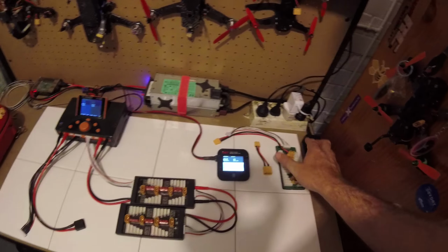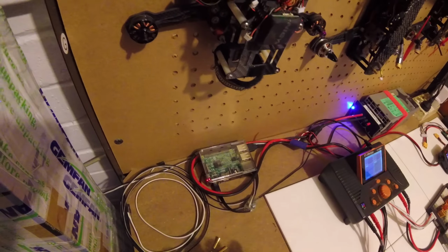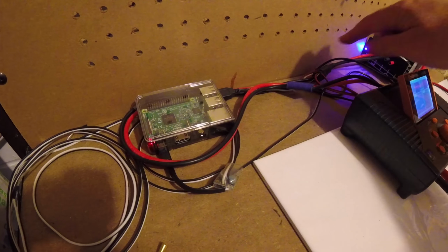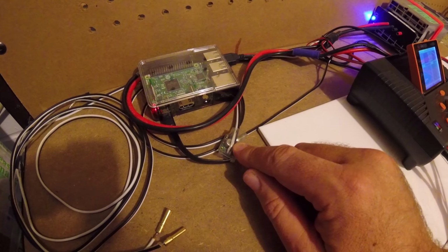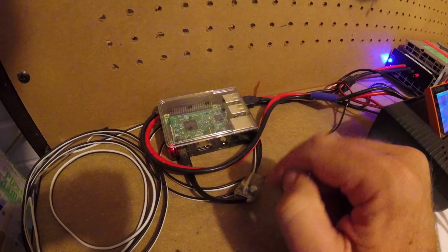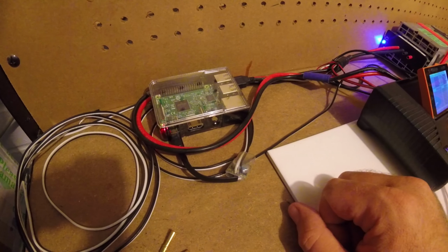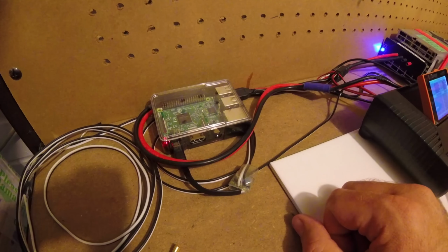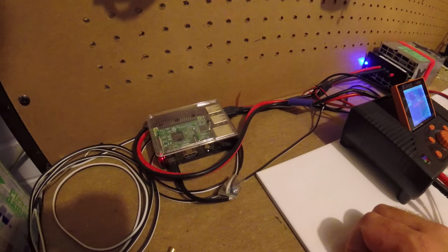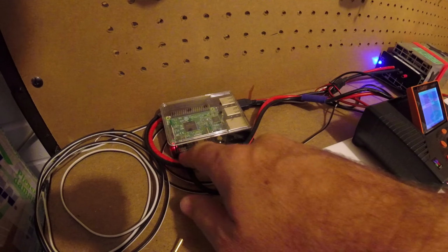So the really intriguing thing now is what's going on here. This is the Raspberry Pi, and I've hooked it up to the 24 volts via a regulator to get down to 5 volts. These things need about 2-2.5 amps, so you need a decent power supply on those. I wanted to run through this because I wanted it to have a common ground and have everything sharing ground there. There is an issue you can get with these chargers with ground loop voltages and things. You can blow up your Raspberry Pi if you're not careful, so you have to watch that. So that's just power going in.